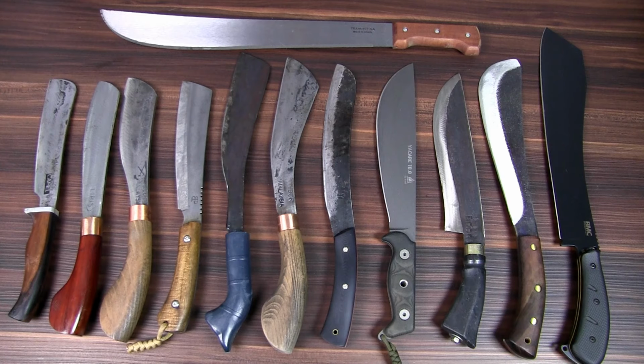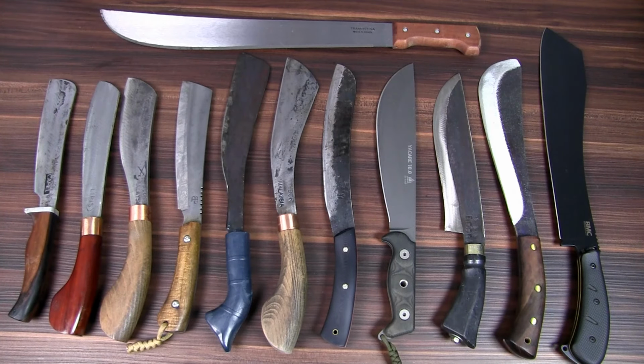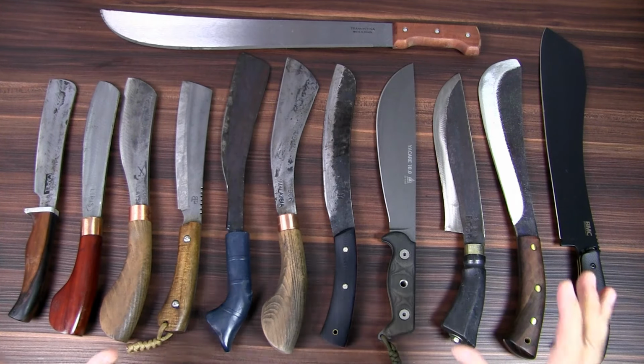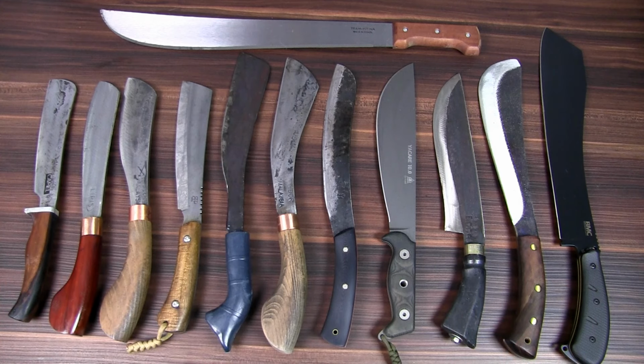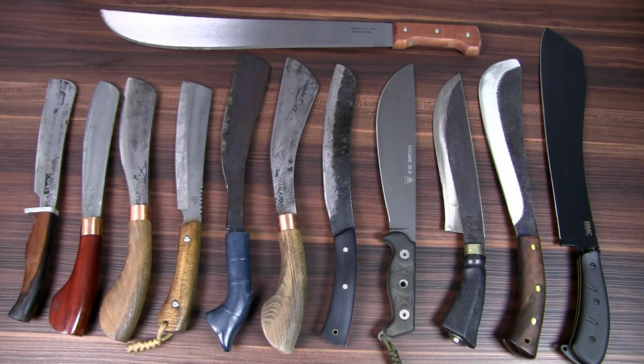These are all very popular high carbon steel choices, and honestly they'll all work for the parang because they are tough and you can always get a keen edge with sharpening it, and they're generally easy to sharpen. So go with a tough steel rather than a harder steel that might chip, because a parang is meant for heavy duty work. You can go for a harder steel for your belt knife. So that's about steels. Let's talk about length next.